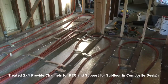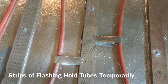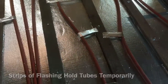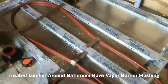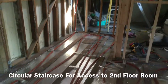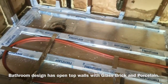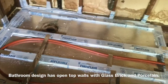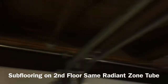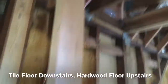We will pack concrete over this. The tubes are being held down right now by aluminum flashing that I've bent and used in various ways. One reason you'll see a lot of extra tubing on this side is first we have the stairwells right there and I want to put a lot of heat around that, but also because it was tricky getting in and around the bathroom. The bathroom has a single loop in there — believe it or not, that's all you need. I get to the second floor without much trouble circulating, especially with the pump pushing it around, and then it returns and comes back down.